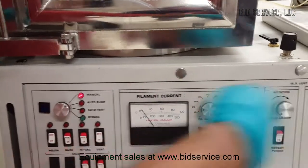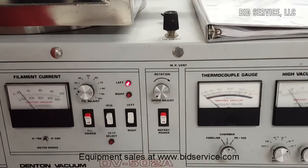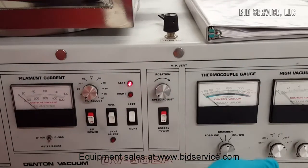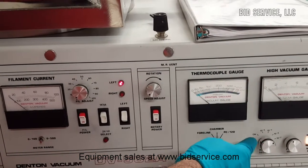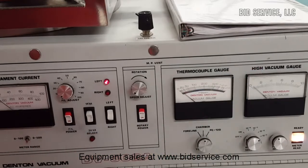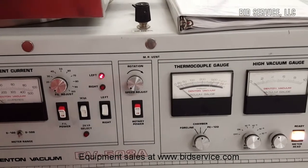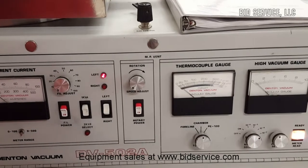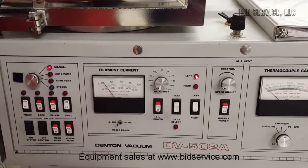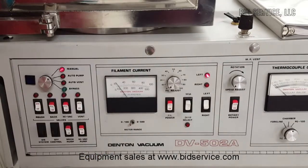You can see that while the filament is hot, the vacuum level is still in the 10 to the minus 7 range. When we start to actually evaporate material, the vacuum will go to a lower range. You should make sure the vacuum doesn't go below 10 to the minus 5 range. If it starts to do that, reduce the current and make sure the material is properly preheated slowly at lower current, then cranked up to melt. Which transformer to select is purely dependent on the filament or boat installed in the chamber.